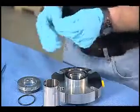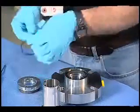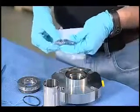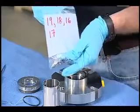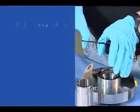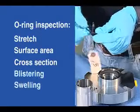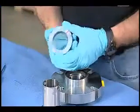In case this seal has been in some sort of hazardous service, I like to use tags for o-rings as well. It's very difficult to inspect an o-ring through a ziploc bag — contrast that to the tagged and bagged parts, which I can pretty much inspect through the bag if I need to look at a surface a second time. With an o-ring, you want to be able to feel it stretch, look at all the surfaces, take out calipers and measure its cross section, and look for blistering and swelling — but here you always have it tagged.